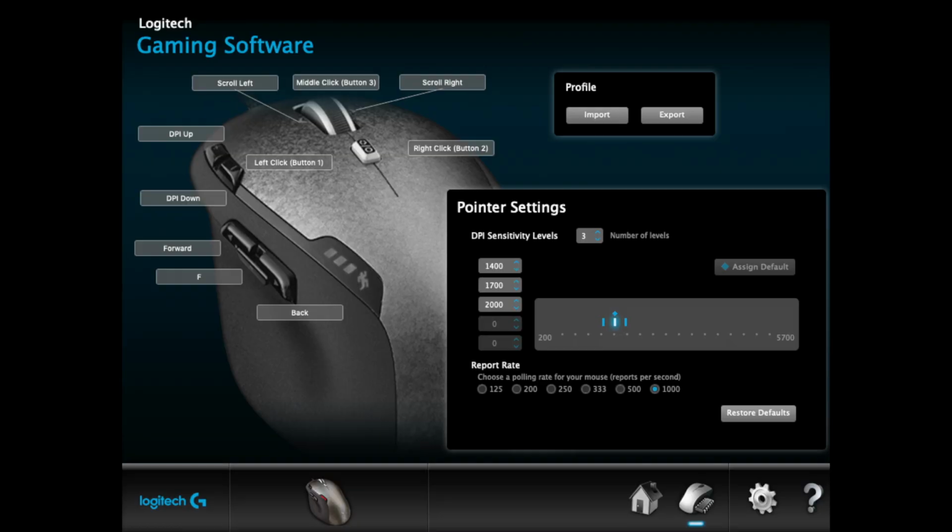And that polling rate is controlled in your software that tells your hardware how often to check for a click. And that'll vary from one mouse or peripheral to another depending on what the hardware is capable of. Now, faster polling rate means that it's going to be asking much more often, so you're less likely to have to click and then wait several milliseconds or whatever until the action appears on your screen. And I won't talk about how that's affected by vertical sync and frame buffers and the frame rate of your particular monitor and the response time, because that's a whole other can of worms that I don't want to get into here, even though that is all interrelated and it does matter too, to a certain extent.